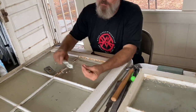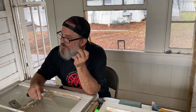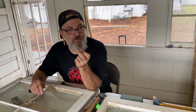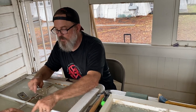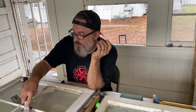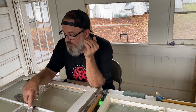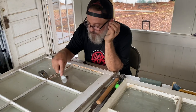Why is this better? Look how small it is. The Home Depot point is what I'd call a corporate glazing point — it's designed just a little bit too big and doesn't work well enough. You have to order diamond points online. They're called diamond points and you can find them under the acronym DP1 or DP2. This is a DP1; the bigger size is DP2, and then there's a DP5 which is a triangle shape. These guys shoot in with a gun — I'll introduce you to that tomorrow.